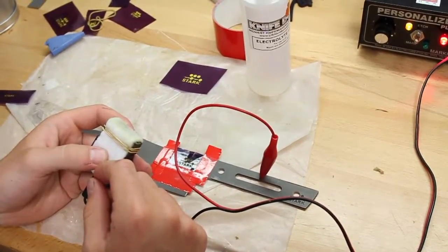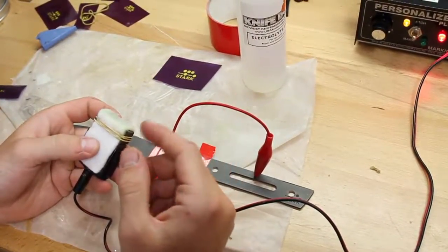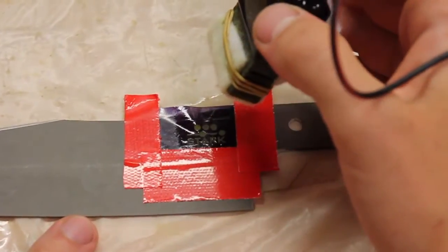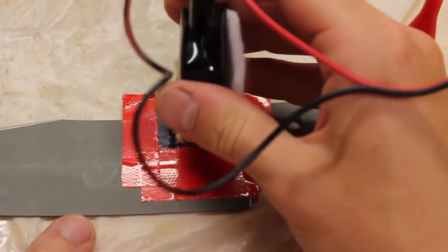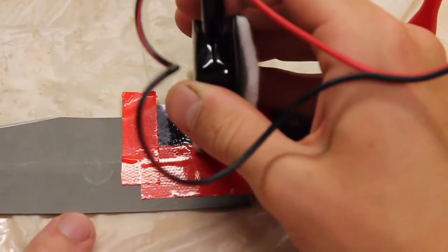Now I'm going to etch our logo into the blade. I do this using a Personalizer Plus etching machine, along with some electrolyte etching solution, and some stencils with our logo in them. I'm starting on the etch setting, which is going to deeply engrave our logo into the knife. I do this like 5 or 6 cycles of 1 or 2 seconds apiece, and then I'm going to switch it to the mark setting, which is going to darken the logo.